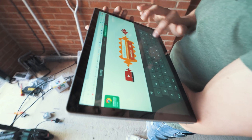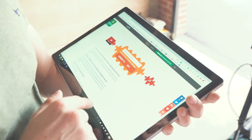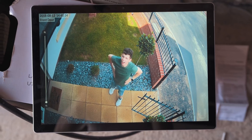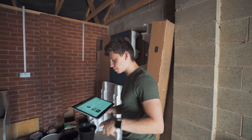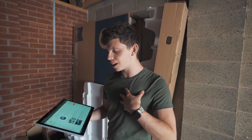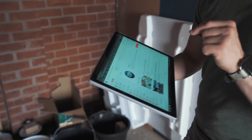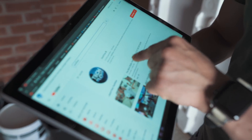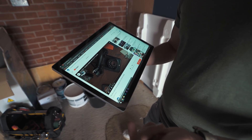Connected to our WiFi plug, I want to make sure I'm actually still on the house network and the plug hasn't created a brand new DHCP range — essentially a separate network. I'm going to access my cameras at 192.168.55.10 to prove we're on the same network. It says this thing is powerful enough on its wireless N end to stream video. Wireless N is getting a bit old school now but streaming is one of the most demanding things you can do over WiFi — so let's see if this WiFi extender smart socket is up to the task.